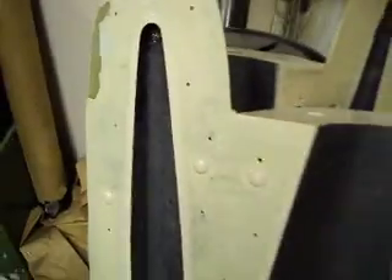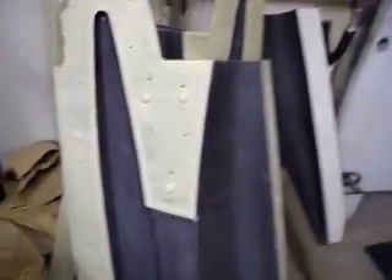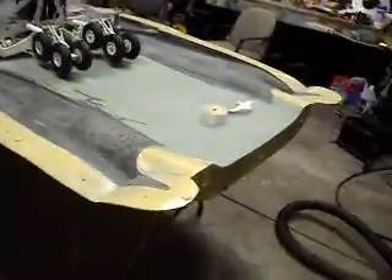This piece back here — I've been talking to Butch and I just won't be able to get in there to do that. So on the back of this bulkhead I'll just leave it, and after we pop it out of the mold I can cut that end off, get in there, tape it, put a little flange on it, and glue it back on. Then I'll get my two bottom ones on. I'll have the mold turned upside down, and when those two are already bolted together with my bulkhead inside, I can bolt it up to that piece and get right to it.